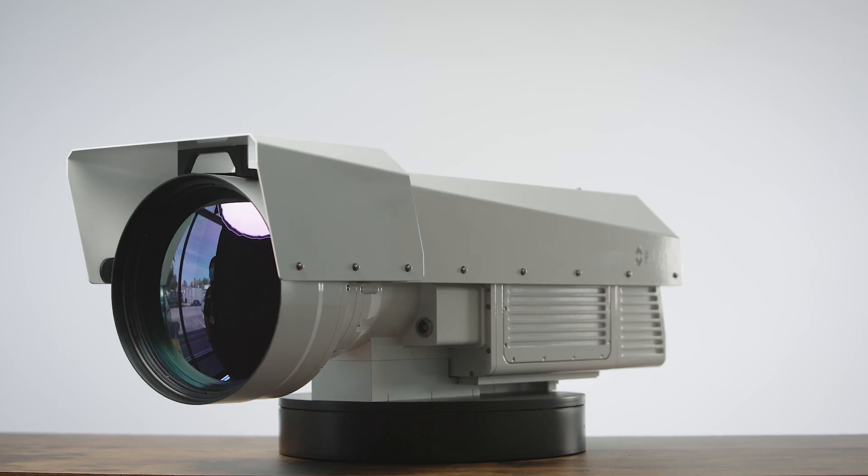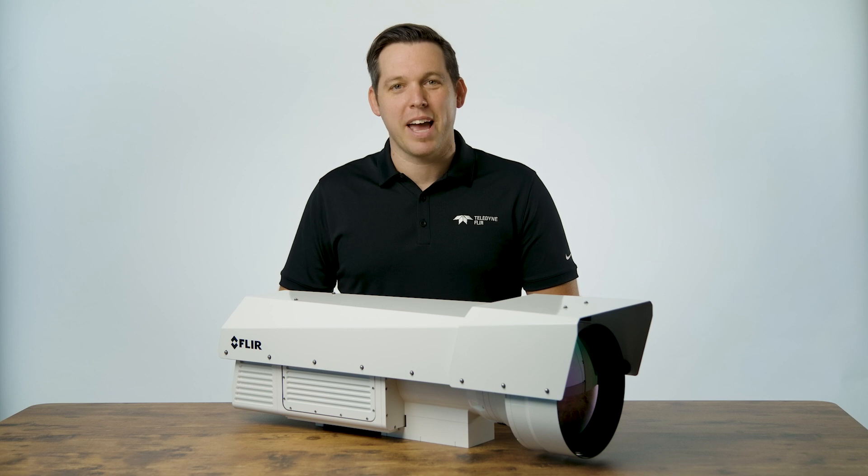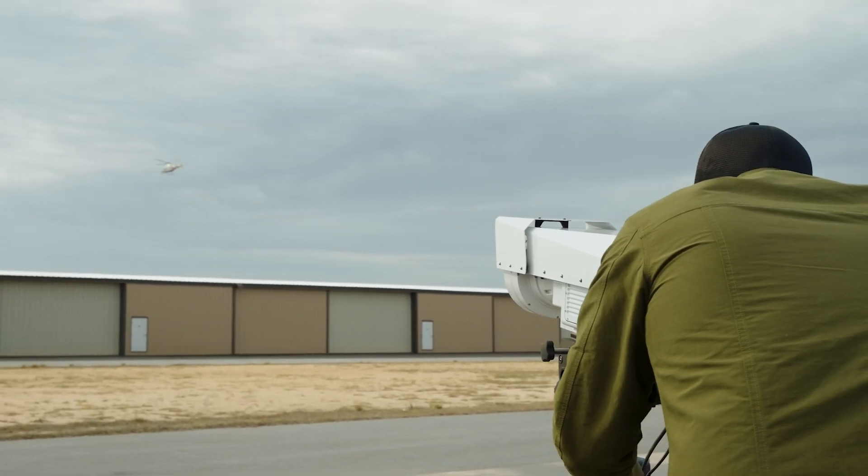These lenses are unique to FLIR range science cameras and bring the capability of supporting advanced radiometry calculations over a wide range of focal lengths. They do this by stamping every frame of data captured with instantaneous, accurate lens and focal position information. By combining distance information with a known focal position, the researcher can capture and measure vital in-band spatial information, supporting advanced applications like target signature research and long-distance thermography.